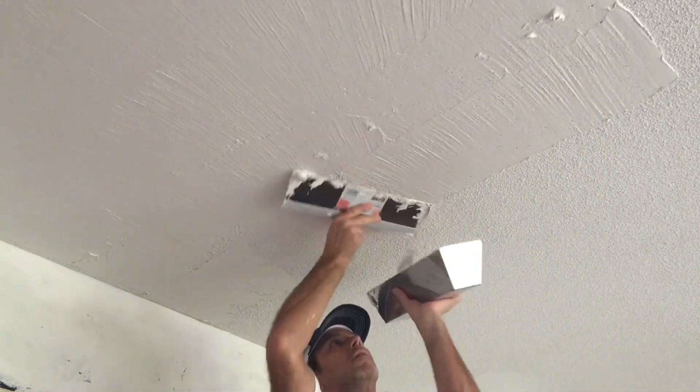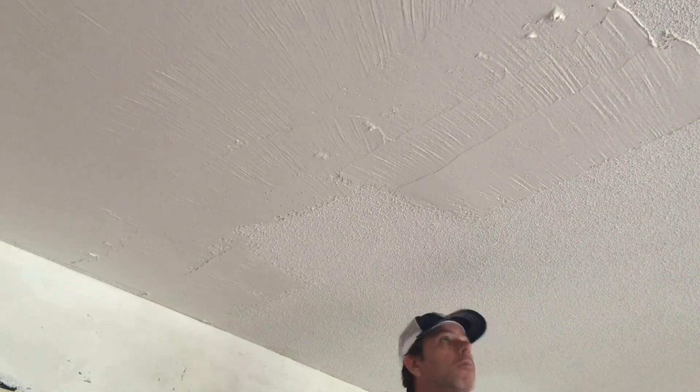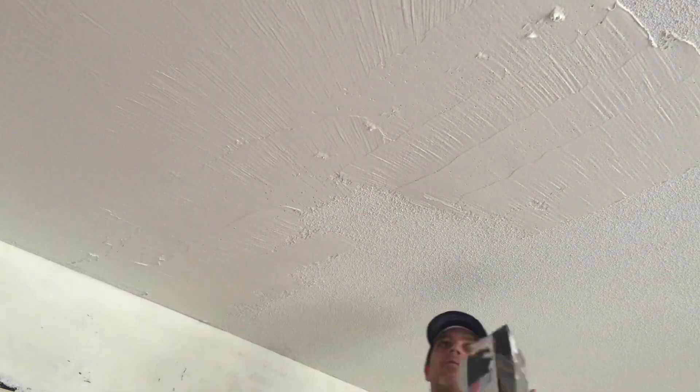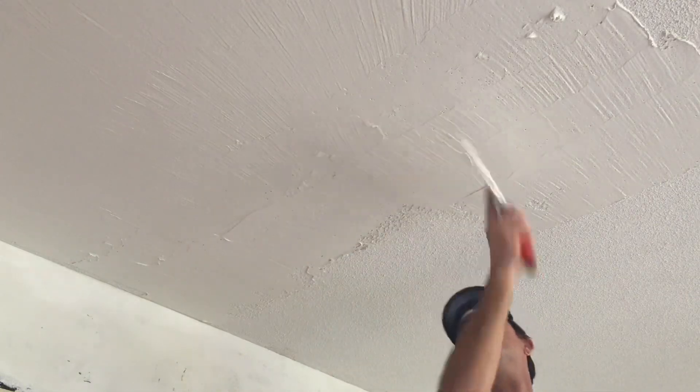Here are a few reasons why you might want to skim coat by hand first. The first coat, when you're going over a texture, you don't want to thin it down enough to use with a paint roller because it needs to be a thick pancake batter consistency. When you're going over a texture, you want to keep the body of the joint compound intact so you don't have to keep doing multiple coats.